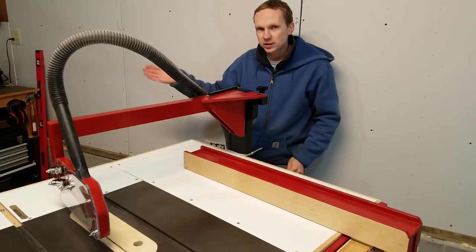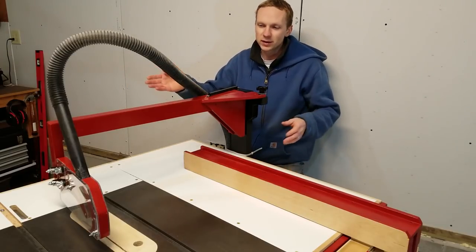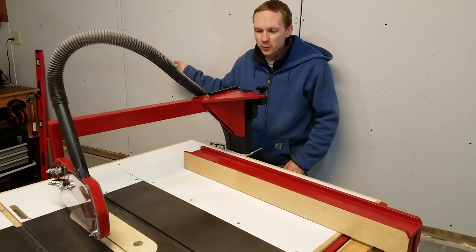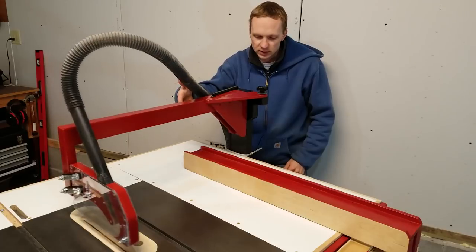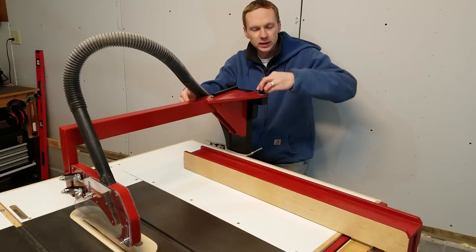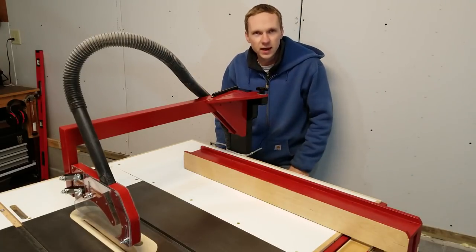That just helps keep the arm out of the way. Previously, without the spring, occasionally the arm would want to come back on its own, which is pretty annoying and not really that safe when you're trying to make cuts. So the spring helps keep it open and helps to bring it back closed. To bring it back closed, all I've got to do is screw the knob down two or three times — it clamps it very securely and is pretty fast.